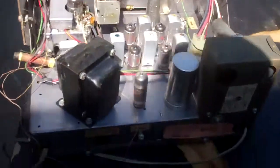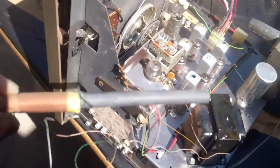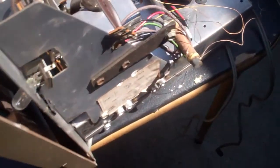Okay, so here's the tuner model 8 TU8. That single wire was just for a pilot lamp, so I've got to fix this — looks like about a quarter of it has unwound. That shouldn't be a problem, but the holder for it is just crumbling. I'll put a tie wrap on it or something. Looks like I bumped that bulb loose — it's just a 194 auto bulb, looks like.